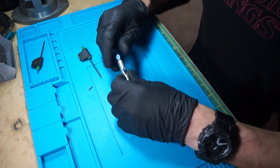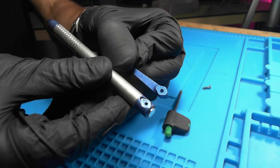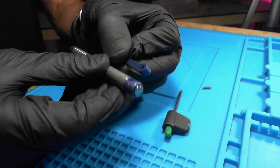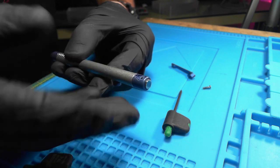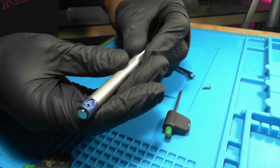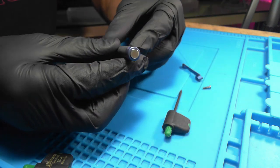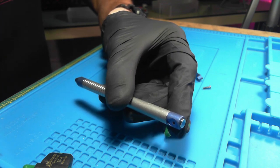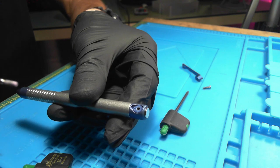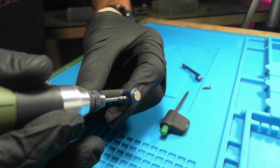I screw the cap in. This part's relatively tight. I machined these two diamond pieces — they're a very, very tight fit. Then I tumbled it, and when I tumbled it, the little edges on either side of this pocket were rolled in a bit from the tumbling process, because I aggressively tumbled these to get that nice matte finish. That meant this clip was a no-fit — it wouldn't even register to start being pressed in. So on these, I actually had to grind each one of these. You can see a little bit of shininess on the inside where the surface is different because it was matted, and then I took it and ground those edges nice and smooth.